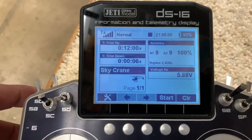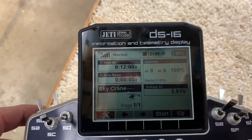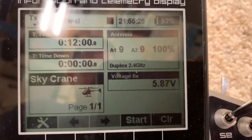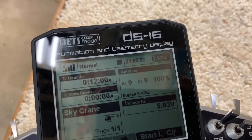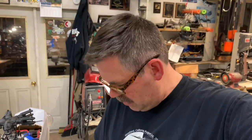I'm giving it collective, which is all four servos at the same time, and I'm getting a not-huge drop — getting down to 5.77 volts. I think I have it set at 5.9; I can't remember what I have set for the back. So whenever I do get out and test it again after the coronavirus is gone, we'll see if we actually get some serious voltage change when actually flying around. I've never had a problem with it, but you never know.